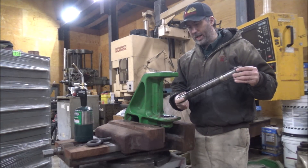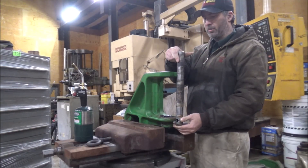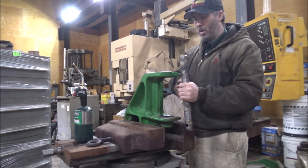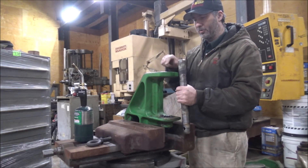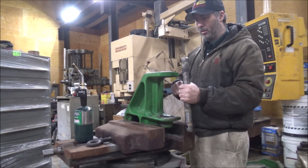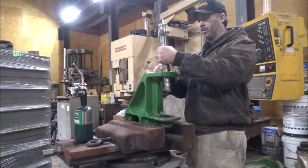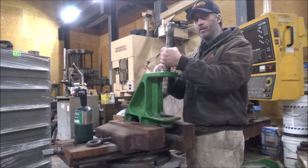There's the pin that came out of it. Supposed to have a bolt down here in the bottom to keep this from turning. So the wear is supposed to occur in here, but the bolt broke and it didn't catch it. So it was turning in this because there's less surface area here than there is here. So the friction was lower, so it turned that part and wallered this hole out. And now it's like this.